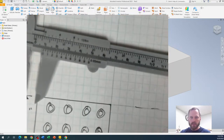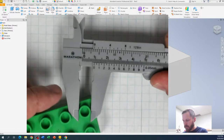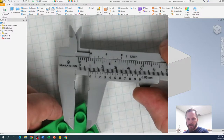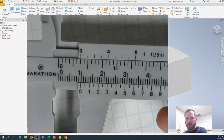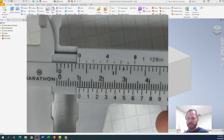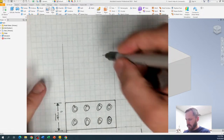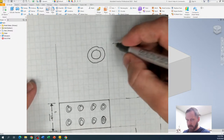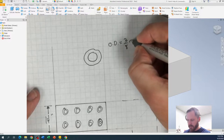Let me fix my camera. Let's take some of these measurements. For our outer diameter, I'm going to round up ever so slightly to the nearest sixteenth of an inch. I see on my calipers that is six sixteenths, which simplifies to three eighths of an inch. I'll note this — this is our big stud. So our OD, outer diameter, equals three eighths of an inch.